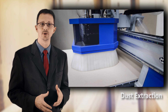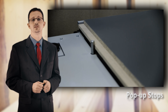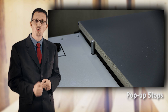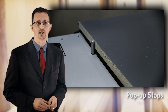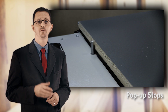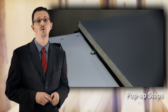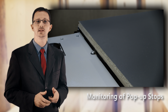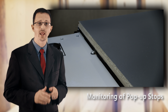The pop-up stops used to locate the workpiece on most CNC machine tables are also something to carefully look at. These stops are important for accurate positioning, especially when doing secondary machining to the same part. If these stops are not manufactured correctly or are lightly bolted to the machine frame, they can easily bend or stop performing correctly. If the stops do not drop down prior to machining, you can have a very expensive crash — Format 4 offers monitoring on these stops to avoid destroying the job, the tools, or even the head of the machine.